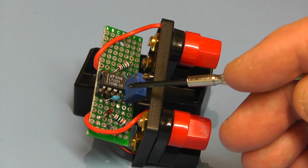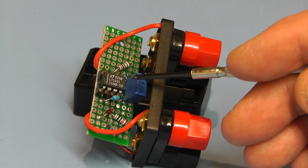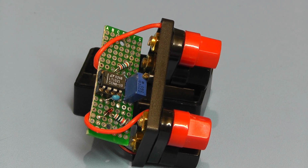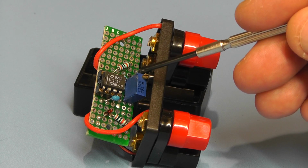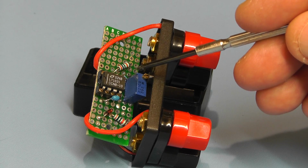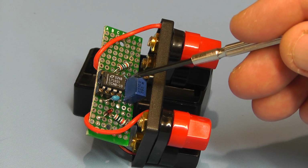The IC that's in here, interestingly, is the Linear Technology IC, which is LT1021, whereas when I saw the unit advertised on eBay, it referred to the chip that they used as being the Texas Instruments REF102. So it's not the same chip as what they advertised, although it's a similar IC in terms of accuracy to the Texas IC. But I'll just have a look at that and just compare the two shortly.